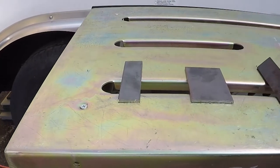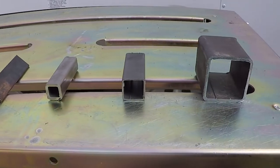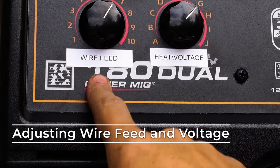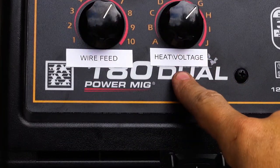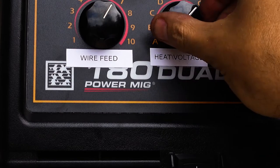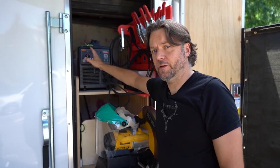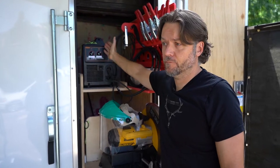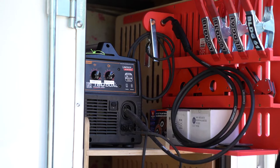Keep this in mind at all times. The two remaining variables are balanced with each other. They are set based on the stock material's thickness or gauge. The wire feed rate dial changes the speed of wire moving out of the torch. The power level dial effectively controls the amount of heat generated by the electrical arc by increasing or decreasing voltage. Generally, when the heat is higher, you need a faster wire feed rate; when it's lower, you can use a lower feed rate. We'll go over this thoroughly at your in-person orientation.